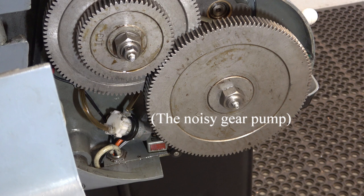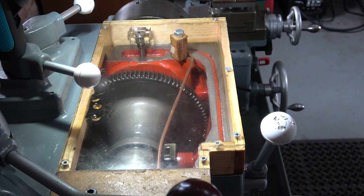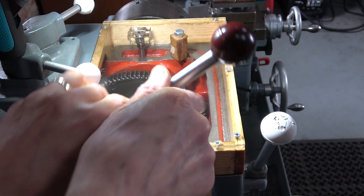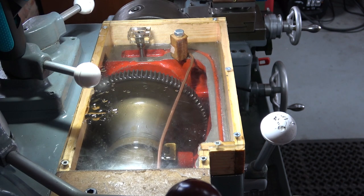There's the little pump sitting just under those gears, tucked away nicely. The feed pipe up to the head is PVC tubing and when I'm happy with everything I might well make that copper. I'll quickly show you the problem again — when I run the lathe on the low range, no oil gets onto this ledge, which means no oil goes to the spindle bearings. That was the top of the lower range, which is 120 rpm.